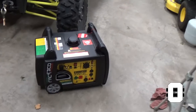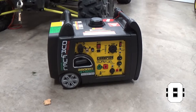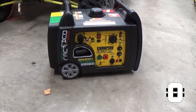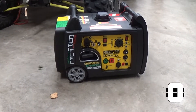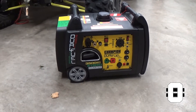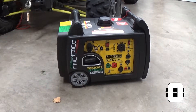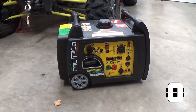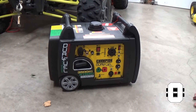What are some of the pros of this generator? Well, it's small and compact, weighs 108 pounds, runs off propane or gasoline. Has a 30-amp RV plug already on it — no adapter cords needed. It's got wheels and a tow handle so you can move it around pretty easily. One person can lift it, though two people is better. It's got two 110 outlets, a cigarette lighter 12-volt adapter, and a plug for two USB plugs. It's based on the Honda engine design — Chinese made — and it's very quiet.